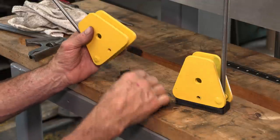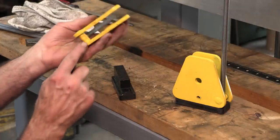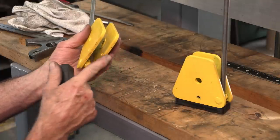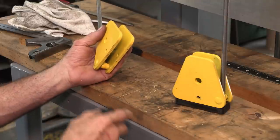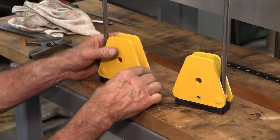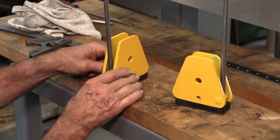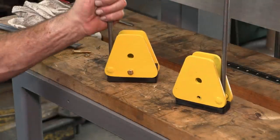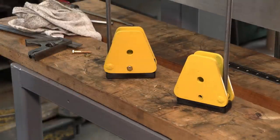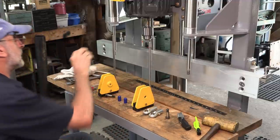All right, I just took two cuts down the side and milled a 3/4 width and depth off of there to clear this rod on the bottom of these. The original design, these two sides here leave a little indent into the wood. So we put rubber strips over it. That took care of the original ones here. But I'm making a Delrin pad now, and this will just bolt right onto the piece right here, and that will hold them in place. And then it's got a nice wide broad Delrin surface to hold the timbers down. Just the same as our air cylinders for the head, when you put on the ball joints here.